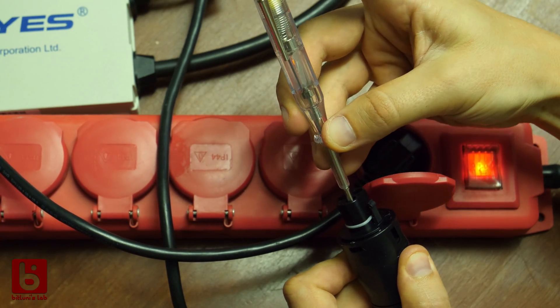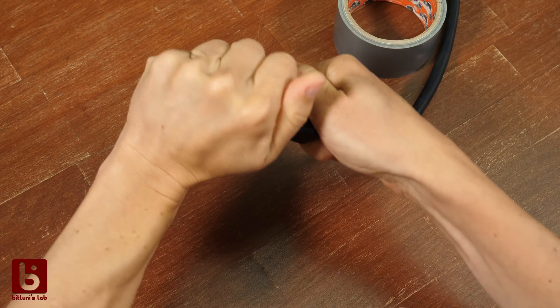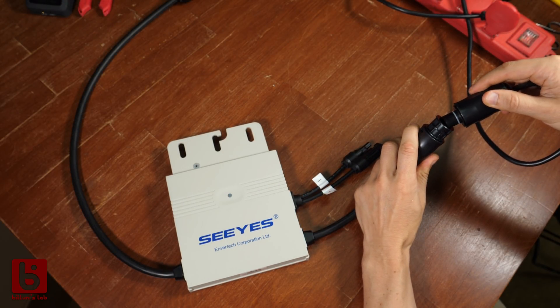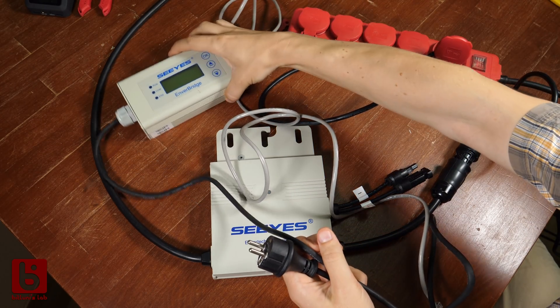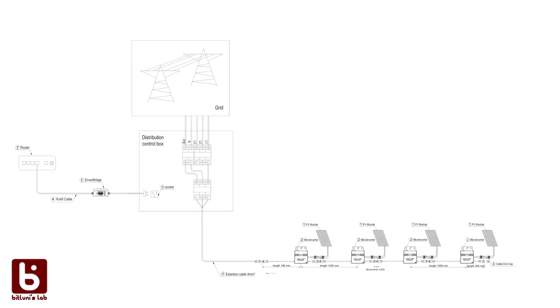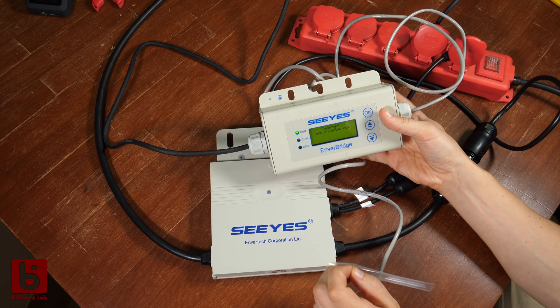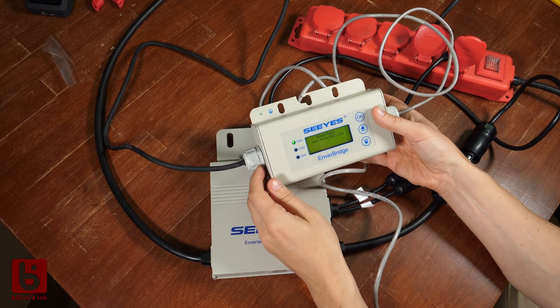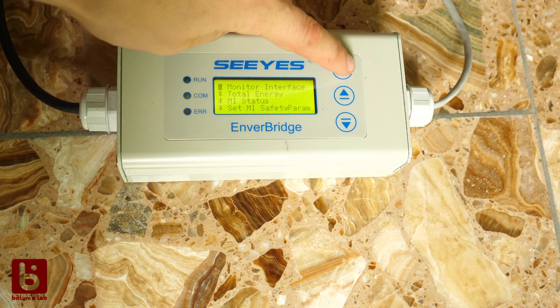In afterthought the female connector would be safer to use since it has less exposed contacts, and I also forgot to order the end cap. But duct tape will do for now. Done! If you want to use the bridge to track all your microinverters, you just need to plug it in. It will communicate with the microinverters over the power line. Therefore it needs to be plugged into the same phase in a three phase system like here in Germany. You either connect to the same outlet or simply test different ones in your place until it's able to see the inverter. When you connect the bridge to your network you will be able to bond the serial of the microinverter to the bridge using a simple tool. It will also work without the network connection afterwards.